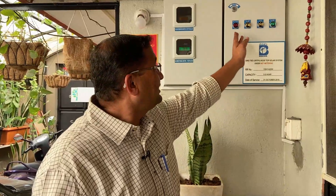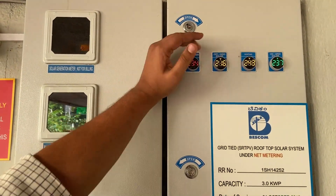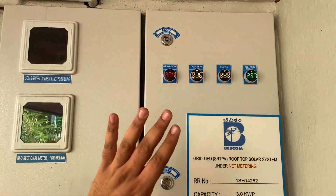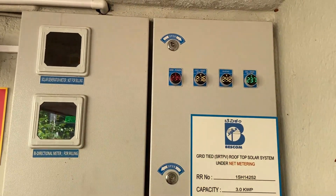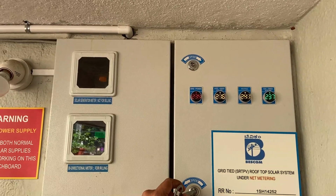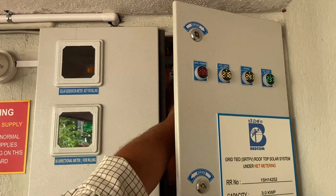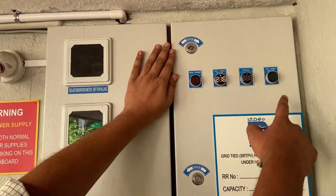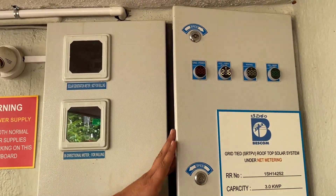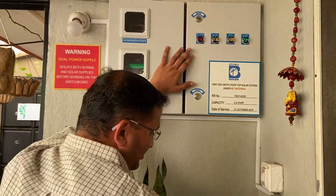A few hours later, we have got the grid power back. The grid is back now — you can see the grid voltage is about 234 volts, but our off-grid solar is around 216 volts. The off-grid system is completely insulated from grid fluctuations and grid problems. That is another advantage of an off-grid system. Now I will deliberately trip the grid and show you what happens. I will switch off the grid power — now the grid power is off. Because the grid is off, our on-grid system is also off, but we are still running on the off-grid solution at about 217 volts.